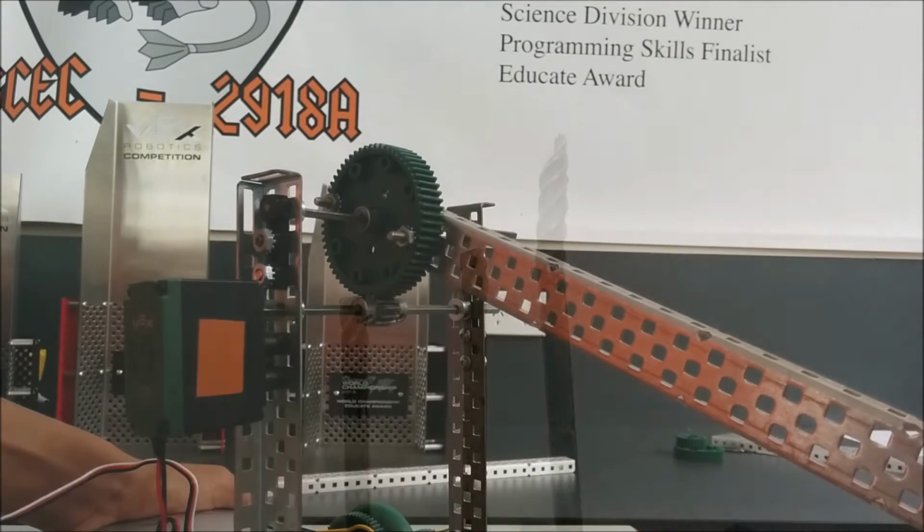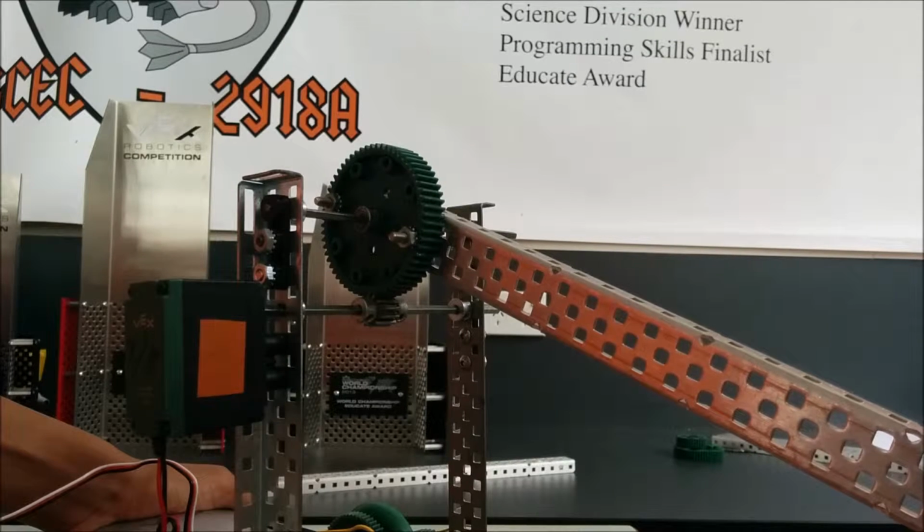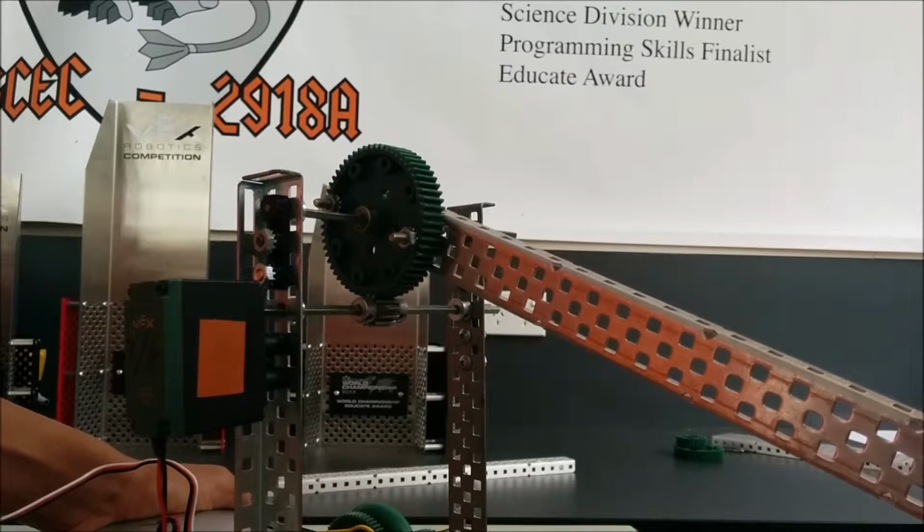One of the results of gear skipping is corkscrewing of axles, as seen here from a Nothing but Net robot. We have also found that if axles are too long, when under load, there is a tendency for them to bend permanently. Here we have an example of an unsupported axle that could eventually bend or twist from the gear skipping.